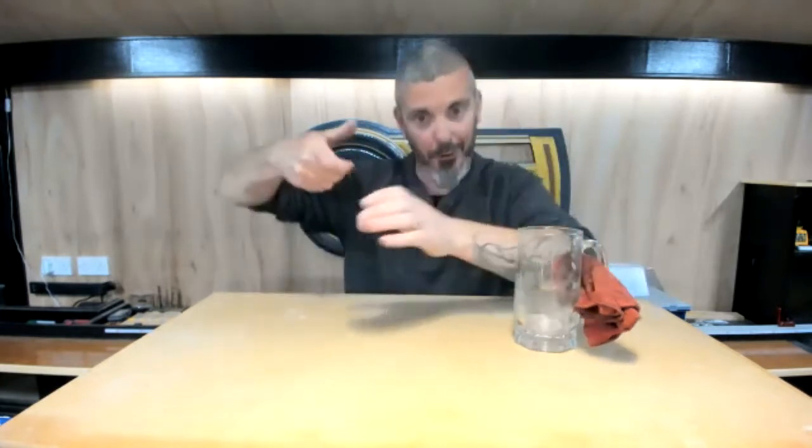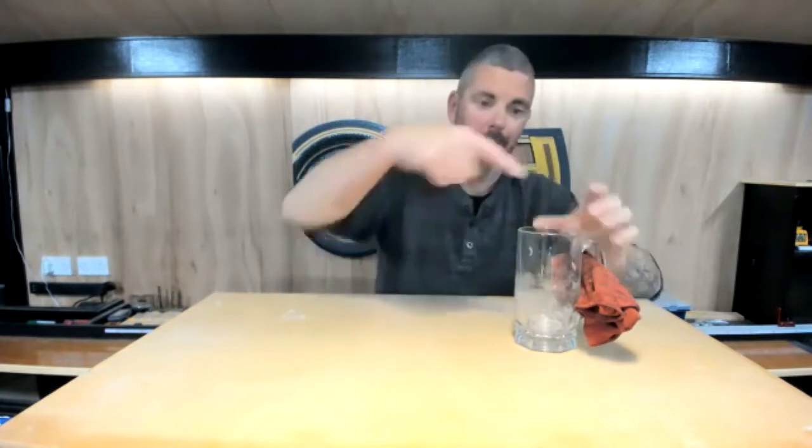The second most important thing about caulking, and it's vastly underrated, is that I would never now go caulking without a jug of water and a cloth. As you get your caulk line in, dip your finger into the water and keep your finger wet. That saves so much unnecessary mess getting everywhere. And caulk being the funny ingredient that it is, it takes a couple of hours to dry, whereas filler takes half an hour, because of those oil-based characteristics. It's almost rubbery.